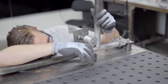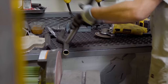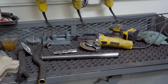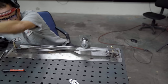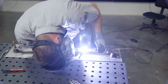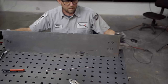I get asked quite often if I still notch tubes without a tube notcher — you bet, I do it all the time. I do have a tube notcher — Rogue Fab was kind enough to send one out to me years ago — and I have used it and I like it, but I still do it by hand. I've been doing it for so long that way that it just doesn't make sense to set something up when I can just run over and cut it out really fast. Just quick tacks, nothing serious. We want to try to maintain three points with a tack weld on them so it doesn't move. Distortion can be a real pain in the butt.